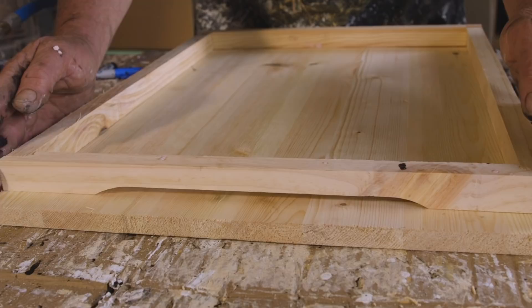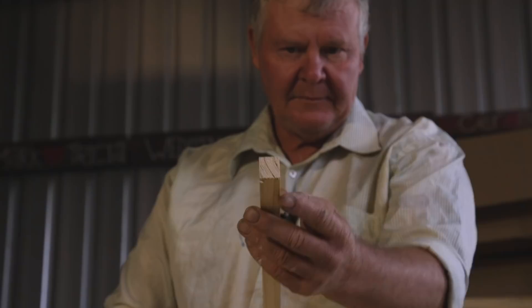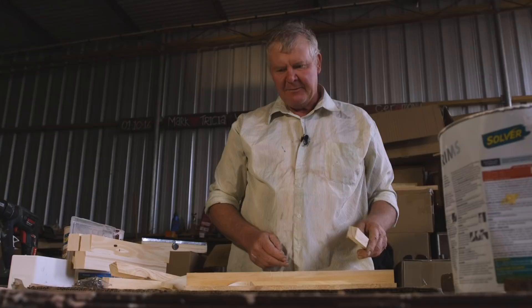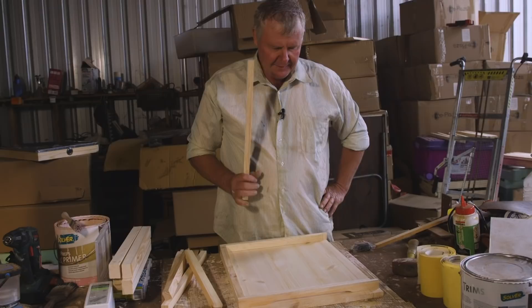You've got to make sure you've got everything nice and square. What I'm going to do is get a little bit of pink primer and just do it around the lip. I don't like to paint the inside of the box completely, but I just like to seal the ends especially. You can see all the porous openings where they've cut the end of the wood, and when it's out in the weather the water's going to run in there, soak and swell that up and cause all sorts of issues. So I suggest that you seal it off.